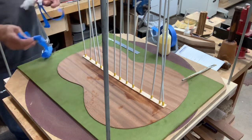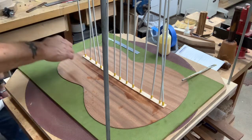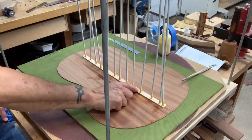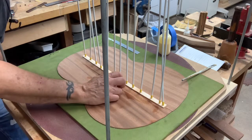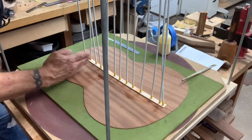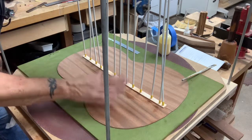I've got a nice clean lamination there. Grain running this way on the back, grain running this way on the brace. So we have a nice cross grain lamination to hold that back lamination center joint together. Okay? Can you dig it? All right, now our next braces will notch over top of these. We're working on getting those done.